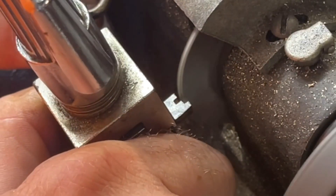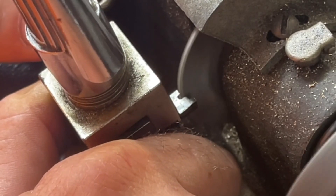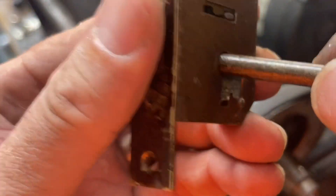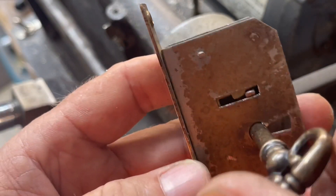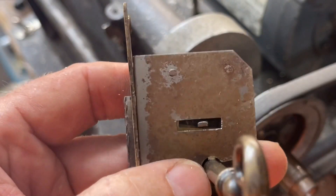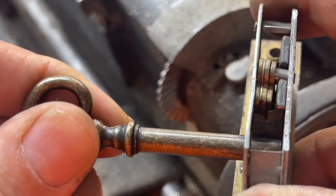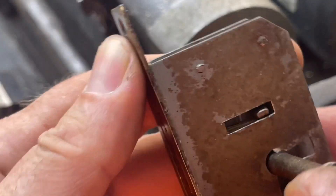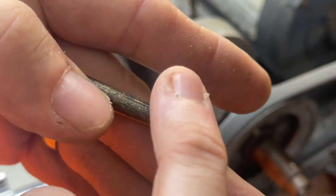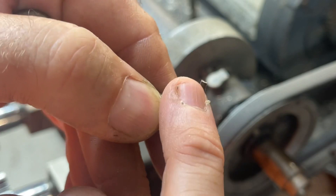We're watching through the window. Now we can see the front. Looks like the third lever — the one closest to the bolt — also needs to go down. Levers one and three both need work. You can kind of see them pressing into the brass right there. See those little marks? They're telling you that it needs to be cut down.